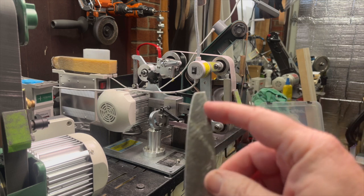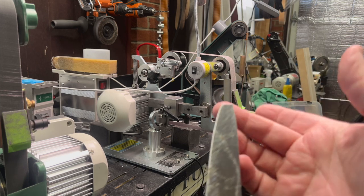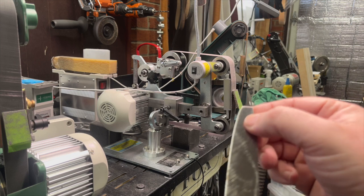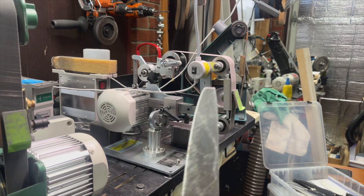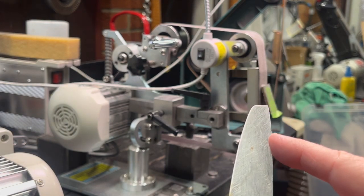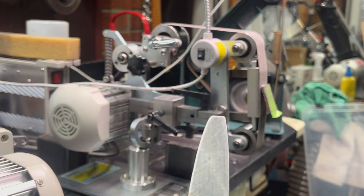Now, why might you want to do it from the front? Well, simply, if a knife continually keeps breaking its tip, maybe it's too thin to begin with, so you might want to grind it towards the spine, into the spine side, and then maybe thin it a little bit and see if that stops the knife from repeatedly chipping and breaking its tip off. But generally speaking, the correct way is to grind from the spine side down and create your new tip. That will keep your geometry proper and you won't have to thin that knife a whole lot.